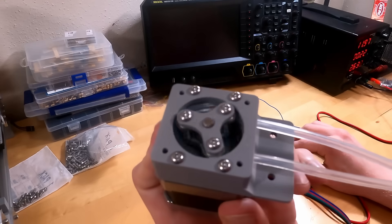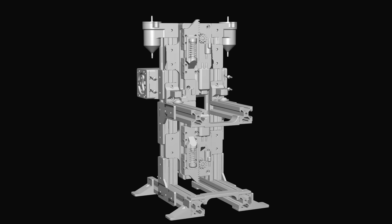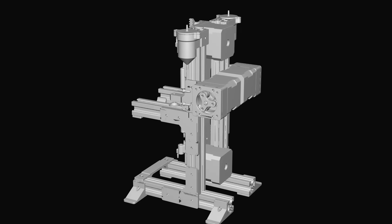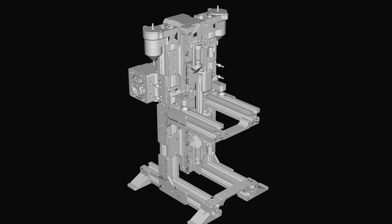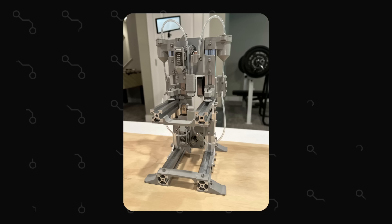The microfluidics and tool head designs were still promising, so I wanted to preserve them, but I completely removed all lateral movement. The second prototype was much simpler than the first. The two tool heads were mostly the same, but I combined the two backplates into a single monolithic component. Combining the parts meant that the alignment of the tool heads was guaranteed by the design — this is what I should have done from the very beginning. After one more round of assembly, I was finally ready to start testing.